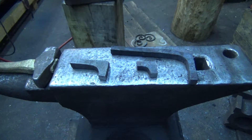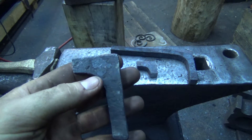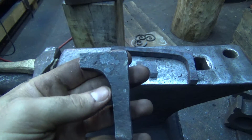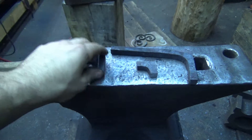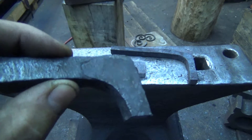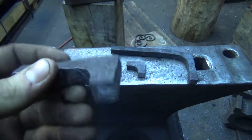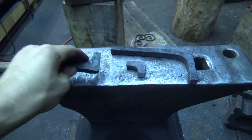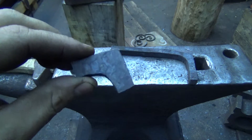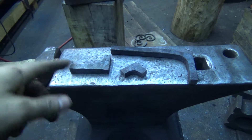So you make a regular square corner - I don't really have an example around here - but if you make a regular square corner, this is rounded, but the corner is usually inward a bit. If you want to make this really fat, beveled kind of look, you have to use a different technique. That's actually forge welding. And the way to control that inside radius is just how much you upset. So if you want something nice and tight, you actually don't have to upset at all. And in my opinion, this is way faster than the upsetting method at the vise or the anvil.